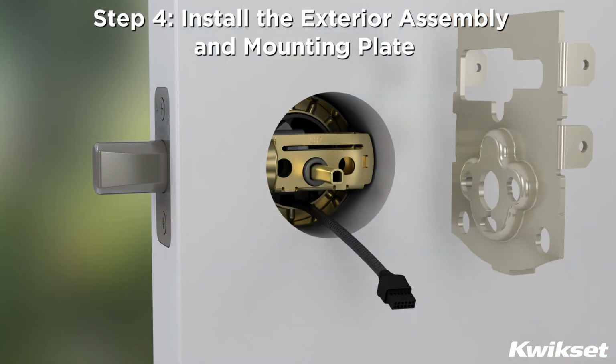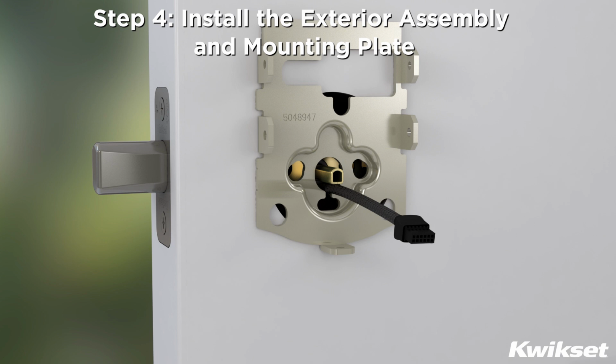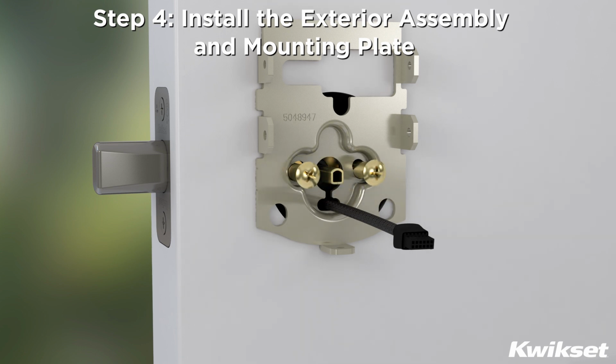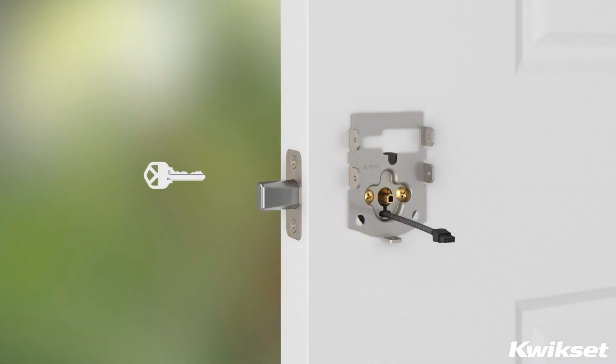Thread the cable and spindle through the center hole of the mounting plate and position the mounting plate so it's flush against the door. Slide the cable into the small notch at the bottom. Secure the mounting plate to the door and exterior assembly with the mounting bolts so it's parallel with the door edge. Insert the key and test the latch.